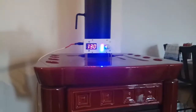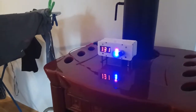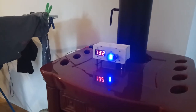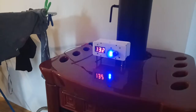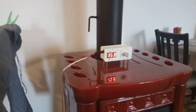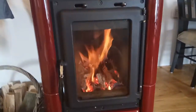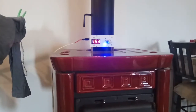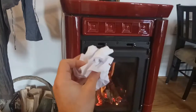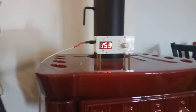It's 130 degrees — we can close the door now. Leave it on the butterfly and it will slow down. Now the temperature has stabilized around 152 degrees Celsius. It's not going up or down — it's a stable, stationary state. The primary air is just a little open and the secondary is still fully open. Just to show you how sensitive this instrument is, I will put just a piece of paper in the stove and watch how the chimney temperature will rise — will this device detect it?